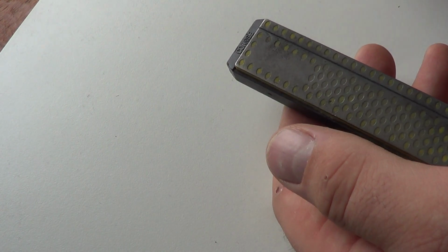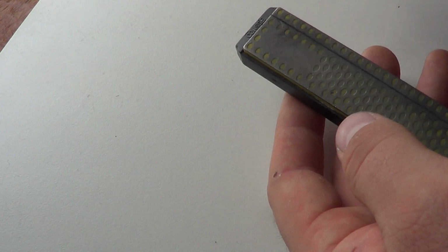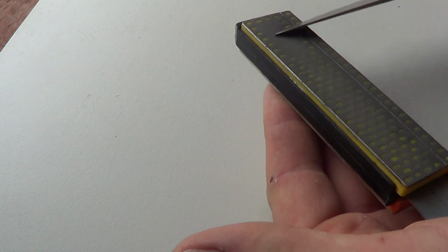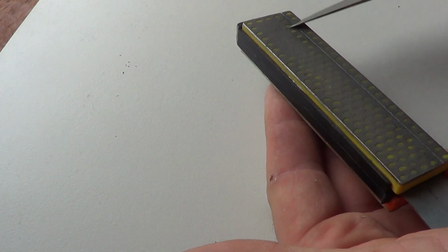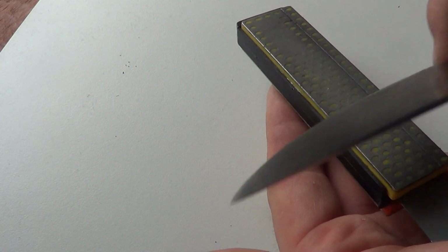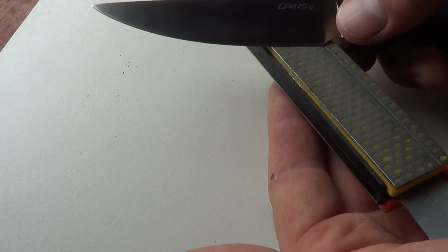The hard thing for me is to explain how you do that when you're sharpening, since that's what you always hear to do. As you sharpen more, you'll see me check the edge a lot, and I can tell by how it's wanting to catch my skin, how it feels, if it's properly forming. So I'm just doing some real light passes. I'm not using much pressure. Keeping a relatively low angle. I think it's around 10 degrees on this knife.